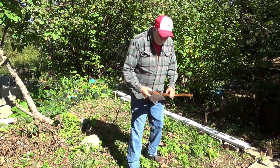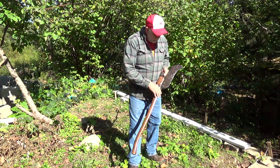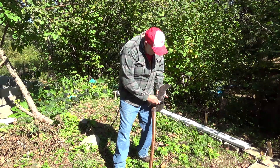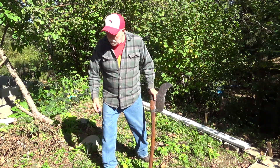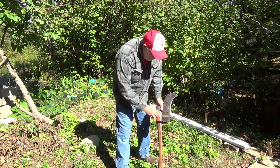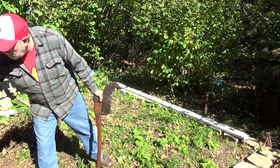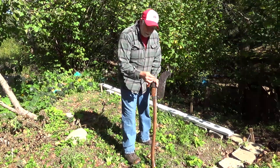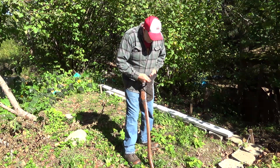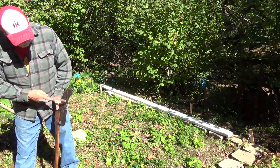These things are real effective for cutting down small diameter trees. You'll have to sharpen it differently than you do a regular axe. I've already sharpened it, but basically the same type of process. I just take that marker pen and put about an eighth of an inch mark along the face. Where it's straight, I just use a regular straight edge file. I use a chainsaw file that I've modified — that way you can get the curve without leaving gouges with a straight edge.